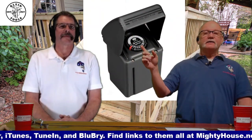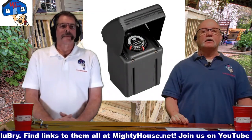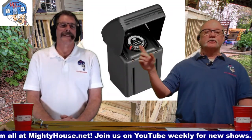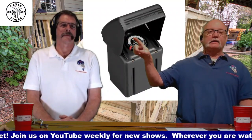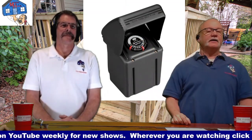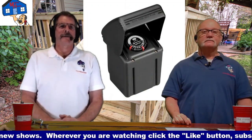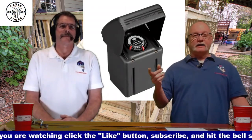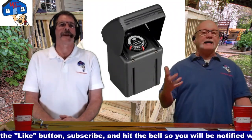You can also just get one of these — if you have a transformer — where you set the time of day and then you set your on and off right there when you want it to come on and go off. You can have it go on and off three or four times a day if you want — you just need more of these little trip switches that go in. That dialer on the outside just spins clockwise. It's just a cheap analog — you can probably pick those up for about 20 to 30 bucks. Those are fairly simple to do, and that's what's running the lights in the back of my house.